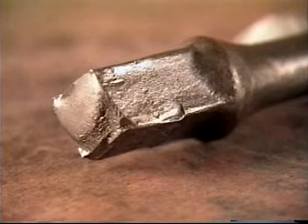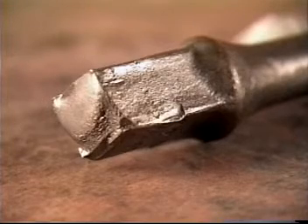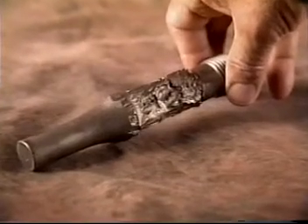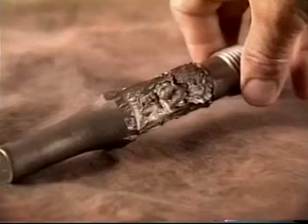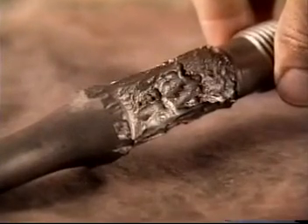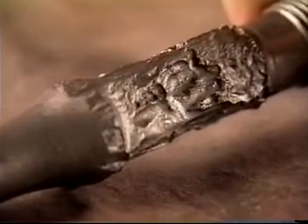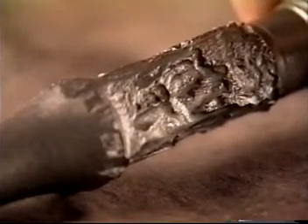Otherwise, as you can see from the example, fatigue failure can result from this type of damage. High-speed fluid cut can be induced by having a large diameter pump plunger with large rods inside small diameter tubing. In this case, abnormally high fluid velocities cause the wrench square and the rod body to suffer severe erosion.